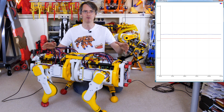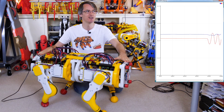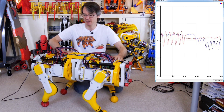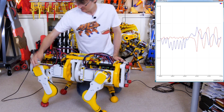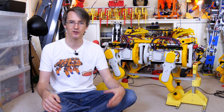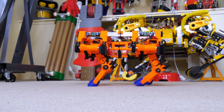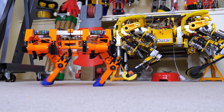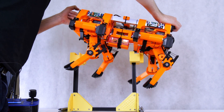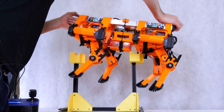I'm using the Arduino plotter so we can see pitch and roll — with the dog powered up and springy on its legs, you can see pitch in one direction and roll in the other when I move it. That's a pretty good sensor for working out whether the dog is level. I used IMU data in the Minidog2 project to keep it balanced while walking on two legs at a time, by moving all the legs forward and backwards in response to that IMU data — transposing that motion over the positions the legs were going to anyway kept the center of gravity in the right place. That's useful on flat floor, but if we were to walk up a hill or over obstructions we're going to need other data.